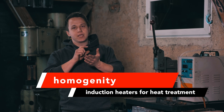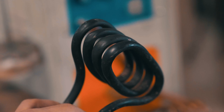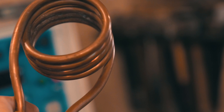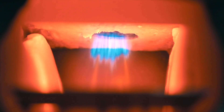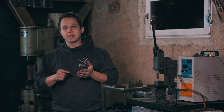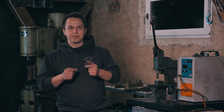Next, let's talk about homogeneity. Can you actually heat up the entire edge of the blade or the entire blade to the same temperature? The answer is it depends on the coil you're using and the operator. It's not guaranteed that you put the knife in the coil and it's going to be all the way the same — it's up to your judgment. So homogeneity is not perfect, it's medium, but it has a huge advantage over a gas forge in that you don't easily overheat the tips. With an induction heater, you can control the heat flow a lot better, and the thinner parts actually tend to heat up last.